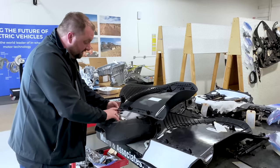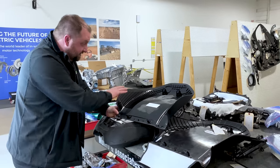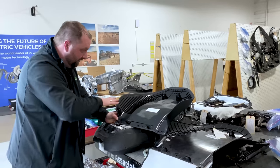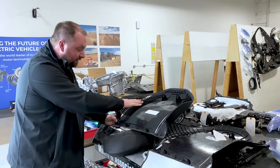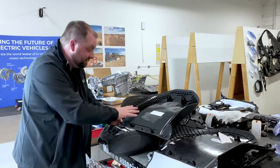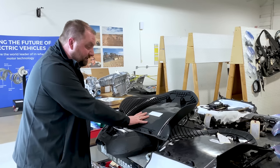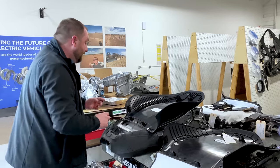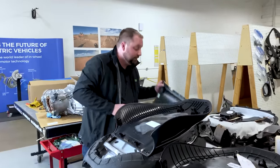I was looking, this is a hot melt adhesive. This is a single cover, no sewing. So they were able to roll coat this flat piece of material with a hot melt, which is very efficient, very, very easy, and then wrap it directly to the substrate and then go through a heating press process. Now that is a little different here.